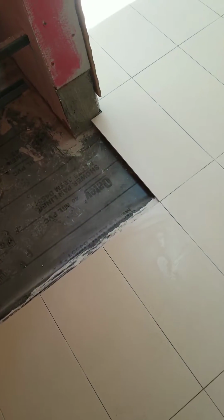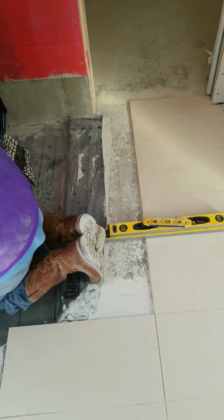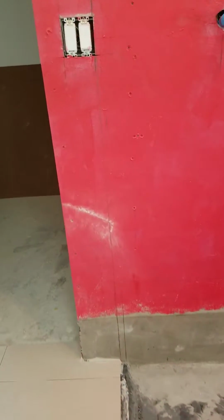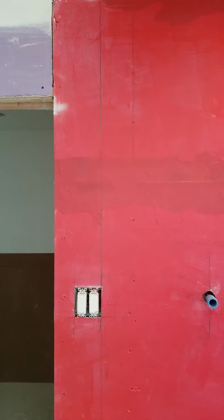And then we've come back, and Martine's done just a fantastic job of patching the floor back in. We had to cut the floor tile out and get the edge of it where we wanted the finish walls to be. So you can see on this side where he cut the tile out, he hasn't put the tile back yet. On this side, he has. So you'll see a pencil line on this wall, and that is the pencil line where the glass is going to go. Well, the glass will be about an inch or so to the right of that line.